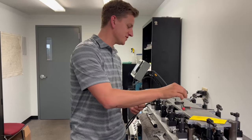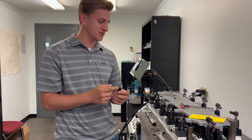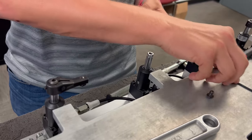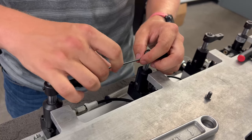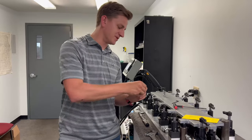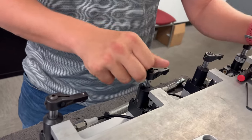What we're going to do first is get our arm. We can see that we have a little set screw, and that's for orientating the arm on the swing clamp. Each of our swing clamps have little dimples for this purpose. So what we're going to do is set our arm on there and then tighten that. Then we're going to grab our top screw and put this hand tight as well so that it doesn't move when we tighten the pinch bolt.